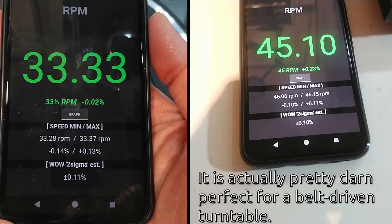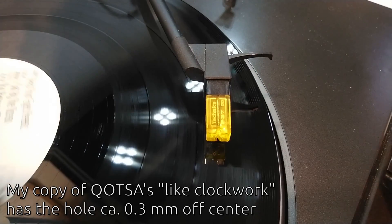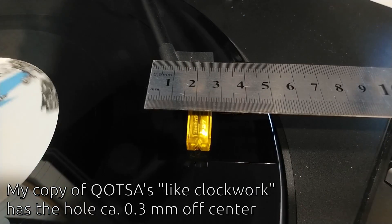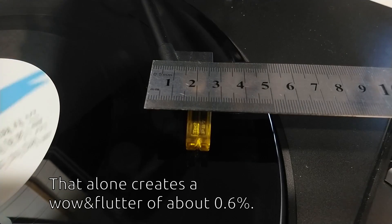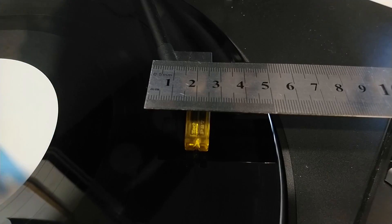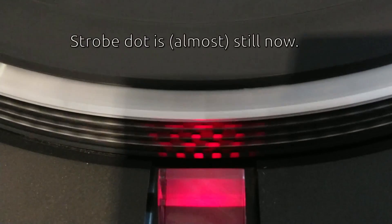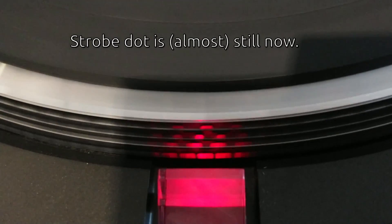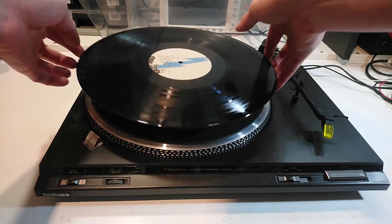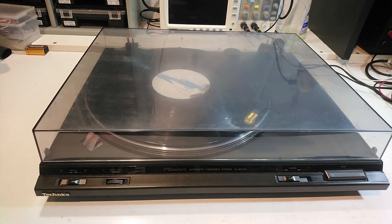The value is not perfect, but I'll take it. Every vinyl record that has its hole punched slightly off-center creates a larger wow and flutter, so this machine is perfectly fine for high-fidelity listening. Now I can confidently hand it over to a new owner. In the end, I think it was a combination of the dry bearing, the crookedness of the platter, and a suboptimal belt that caused the wow and flutter in the first place. I learned a lot about troubleshooting, so it was worth the effort. Thanks for watching — please subscribe and see you next time.